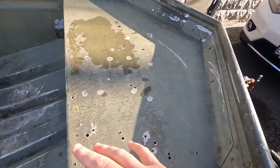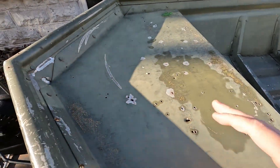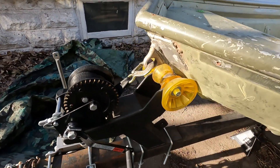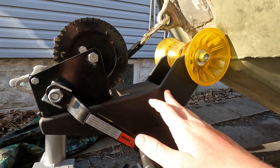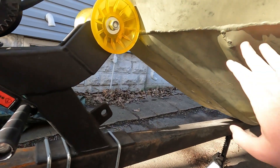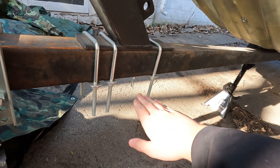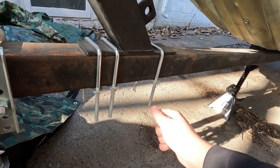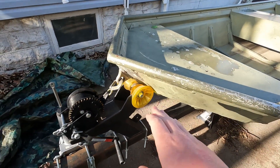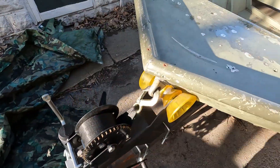On here is gonna be the trolling motor. I know a lot of people like to have the trolling motor on the right side when they build a jon boat, but I previously had it on the left side and didn't mind it at all. I think I'm gonna build it back on the left side. Last time I had a 2x4 and it sat too far in the water. I got a Ranger setup on here — it looks beautiful, works just like a charm. I want it up to about here because when it was like eight inches beneath the surface it ran fine, but any more than a foot it wouldn't run perfectly. So I'm going with a 4x4 this time for the trolling motor mount.